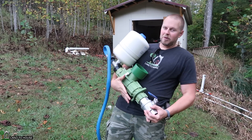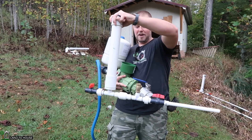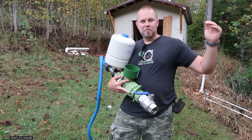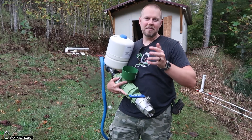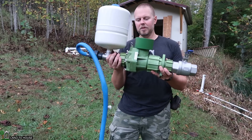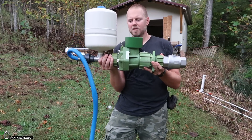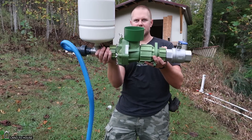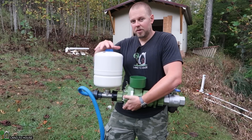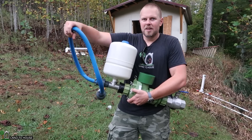If you're not familiar with what a ram pump is, I've worked with them for years. They look a lot like this right here. It's got a waste valve, an inline valve, and a pressure tank. Basically, water will flow into this, fall into the pump, activate the valves, and lift water uphill. This AgriPump is going to have the same kind of thing going on. There are a couple of O-rings inside of this block here that will activate back and forth based on the input head pressure. The circular thing on top is where the wastewater will come out, and the water you're trying to pump uphill will accumulate pressure in this pressure tank and then send water up on this side.